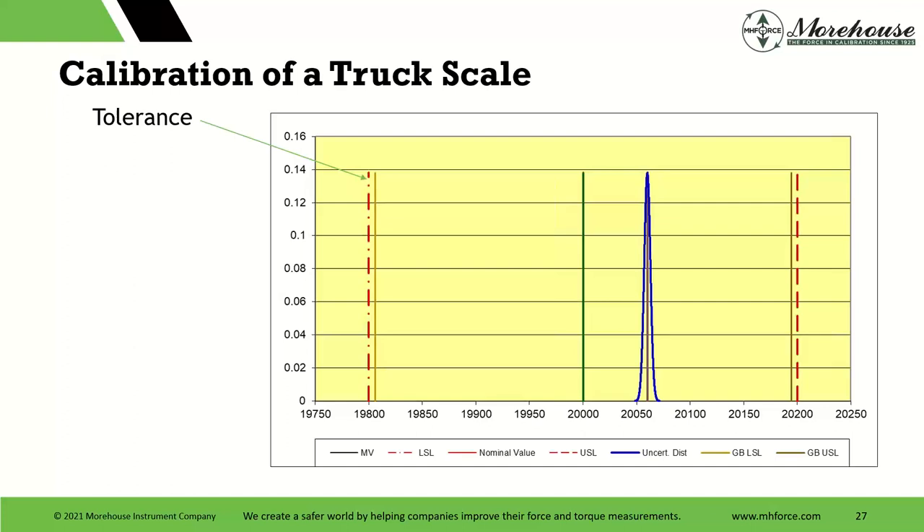If I calculate the uncertainties correctly and look at my tolerance specification limit, anything outside would be considered risk — probability of false accept, false accept risk, conformity, there are numerous terms. We have our tolerance, we plot that on a graph, we have our guard band limit. At Morehouse, we use method five — a very conservative guard band — which means we're less likely to accept something that's really not in spec, so our probability of false accept is very low. Some people take a shared risk approach, saying you share some of the risk with us. But I think since you're paying us as a calibration provider, we should give you the answer you need and not say it's still okay but with 50% risk.